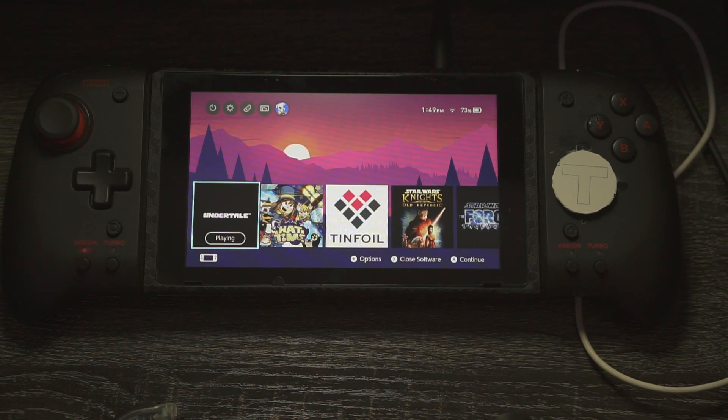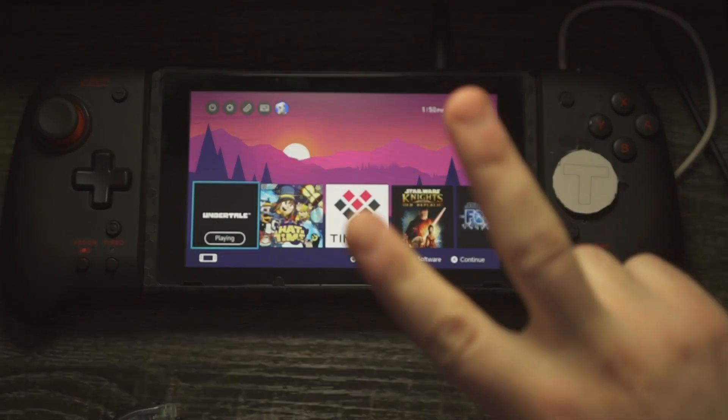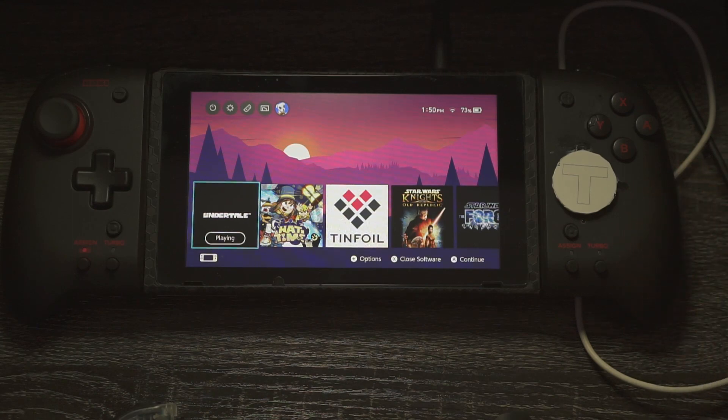The idea was to create a Switch controller that had touchpads just like a Steam Controller. Originally it seemed like a pipe dream, but someone has actually done something similar - a project by Matteo Pisani, I'll link his write-up in the description, who replaced his left Joy-Con analog stick with a capacitive touchpad. So we knew it was possible. Using Matteo's write-up, Max was able to map out the project with one added twist: I wanted the touchpad to also function as an analog stick so the controllers could conceivably be used on any Switch, not just my modded one. So it had to be dual-purpose - it had to act as a USB mouse, which some Switch games actually do support, and also function as an analog stick even though there is clearly no stick there.